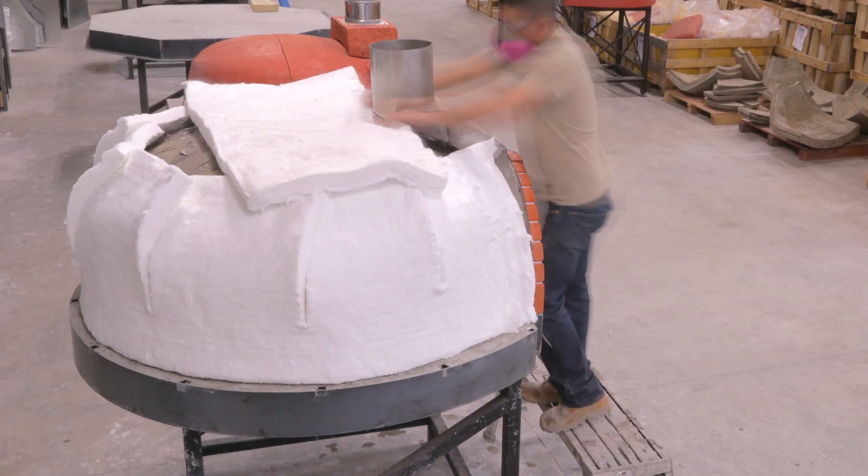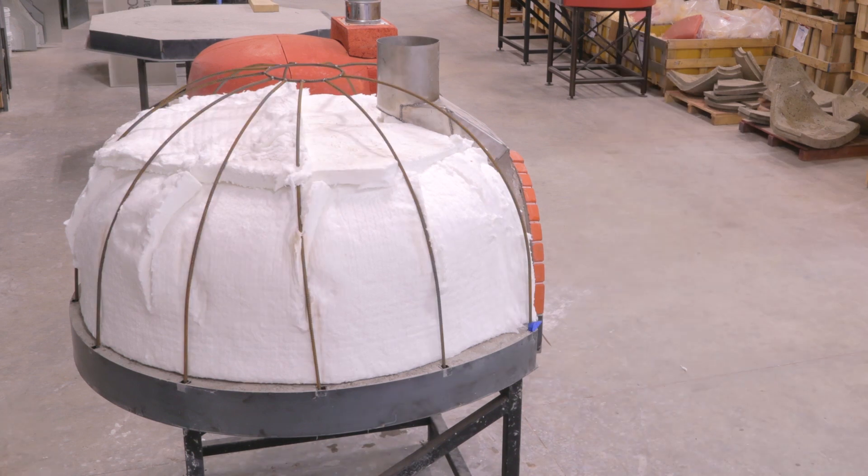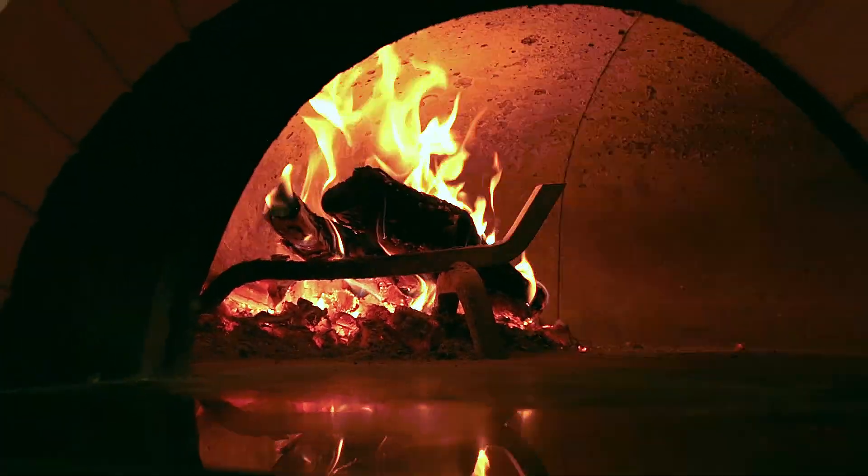Over the crown elements is a soluble ceramic thermal insulation blanket followed by a parging coat. The combination of these two insulating layers assists the heat-saturated crown elements to consistently radiate back down into that bake chamber.